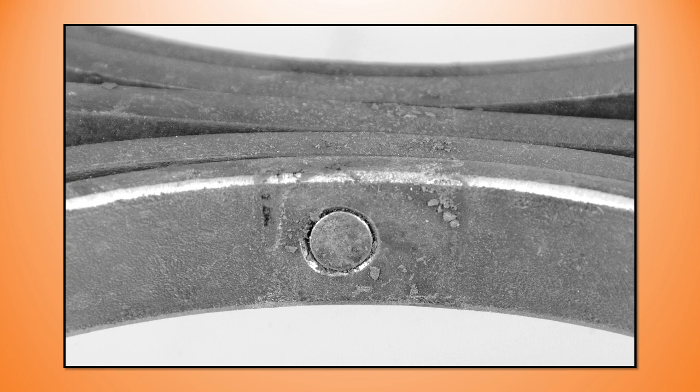Let's talk practicalities before we start. You've got a number of moving parts here. You've got the center style, you've got the corner material holding the square corners and the leaf work, and then you've got the beveled scroll material. I would pin those all together. I've shown a drill hole pinned by a rivet, but these days you'd be equally okay just grinding a groove in there and filling it full of MIG. Whatever is your poison. But if you do fill it full of MIG, don't get it too proud, because you run the risk of skipping with your grinder and making some grinder marks up here, which would not be acceptable.